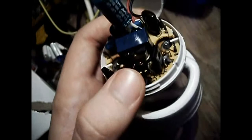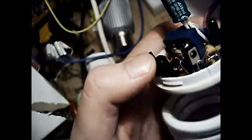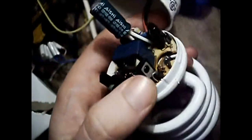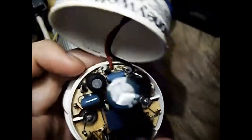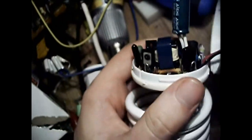There are a couple of plastic film — possibly polyester — caps right there, that little brown one. And there are two others — that one and that one. So they're clearly somewhat high-potential: 1,200 volts, 1,500 volts, depending.